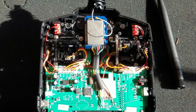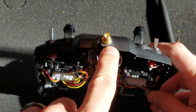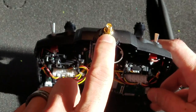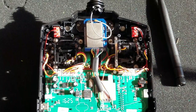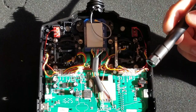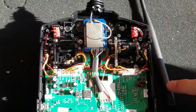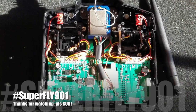That's pretty much all I did to the radio. For the stock rubber duck antenna, I just cut it right where it widens up — that leaves enough material for the hardware from the UFL connection to clamp down. I'm enjoying the radio and haven't had any issues with the mod yet. Today is actually the first day I've had a chance to fly, so I'll do some range testing and see how it goes. That's the Devo 7E — go to the Deviation TX website, start an account, and if you have questions, hit me up. Good luck.